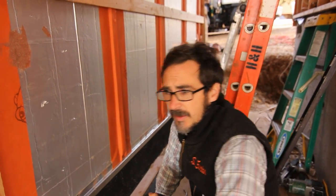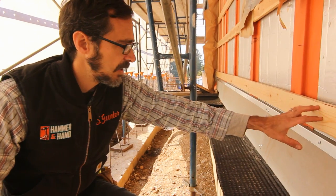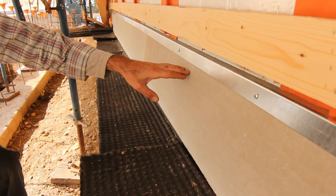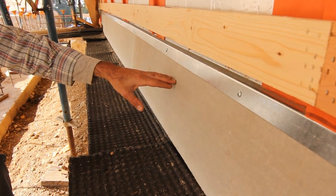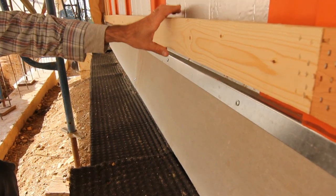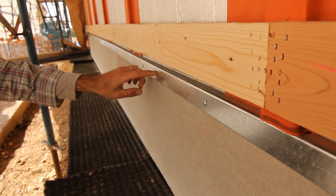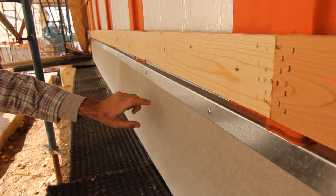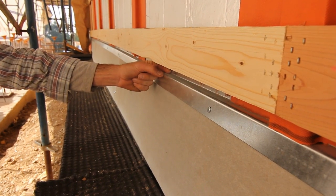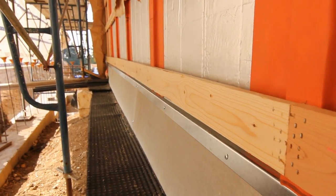Here's another example of our above grade to below grade: we actually have concrete here which comes up to about here. As the siding runs down, it just clears our Z-Metal down to here. We have about an inch gap — air space — and then we have a poured slab right here. You can clearly see how all the components go together. This Z-Metal detail worked out really well; it kind of bridges our drain mat and then our fiber cement panels. That determines this thickness right here. Everything's continuous — anything that comes down this drainage plane goes out and onto the face of the building.